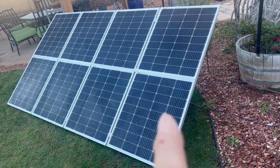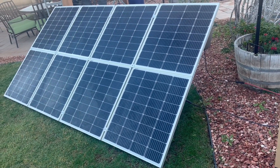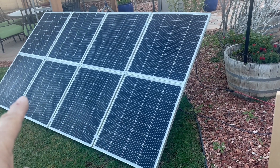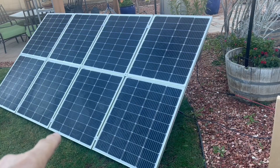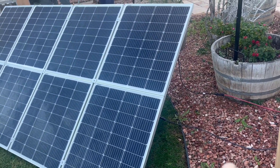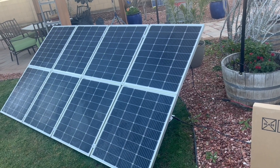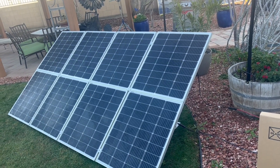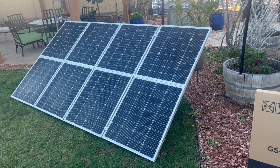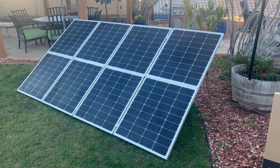With eight panels I think I can get away with it. They also have a very small footprint — you get over 11 amps between just two panels. If I were to put them on my motorhome roof they'd easily span one side to the other, and I could go 12 or 14 panels. You want airflow behind solar panels — don't mount them flat against the surface — you need air circulation underneath to keep them cooler and more efficient.